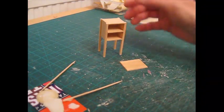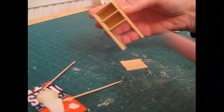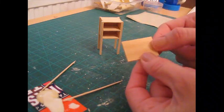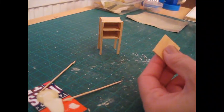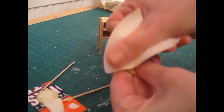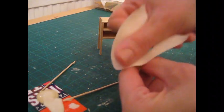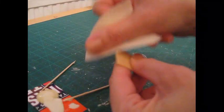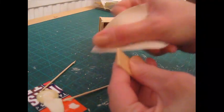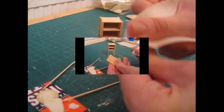Once you've allowed enough time for the glue to dry, remove the tape. I've sanded it all around again on the front edge so I've got a nice flush front. I just want to round over one long edge and both short edges on both sides of this top piece, so I'm going to hold it in my hand and use a piece of fine grade sandpaper. Support the top piece, hold the paper at a 45-degree angle, and just sweep it along — I'm not going too mad, I just want to take away those sharp edges. Then turn the piece over and do the same on the underside.